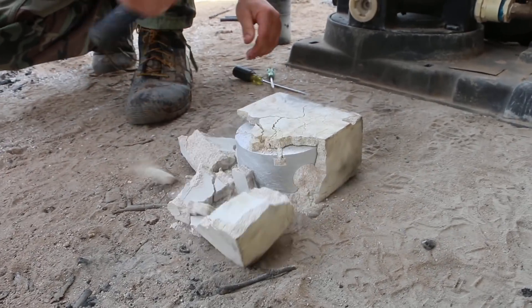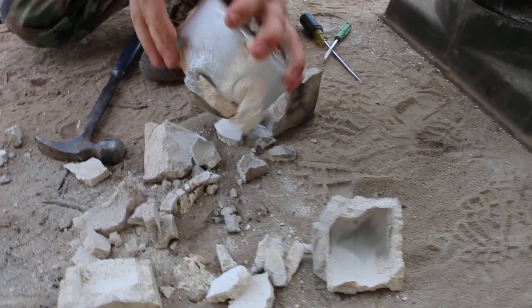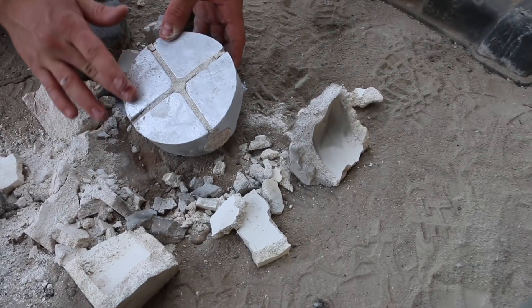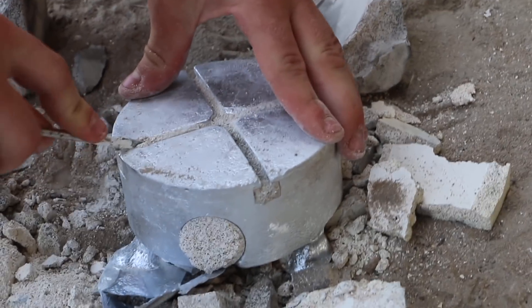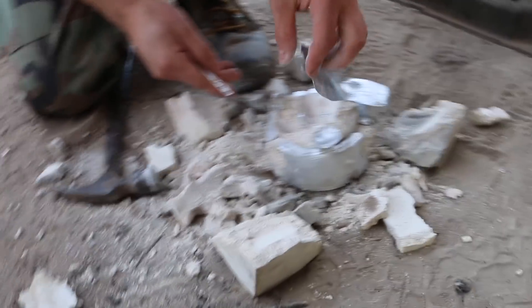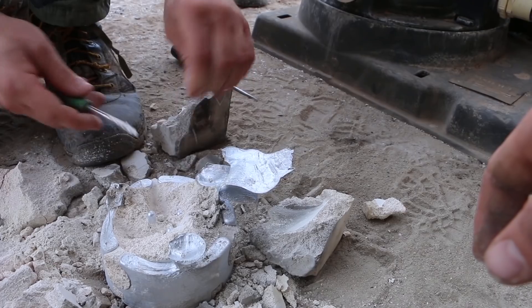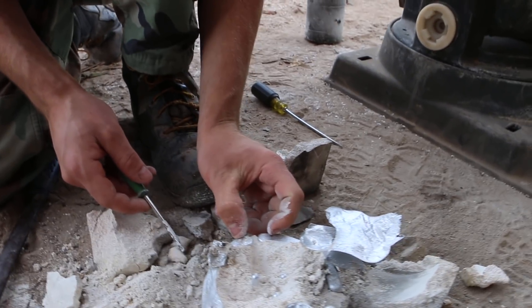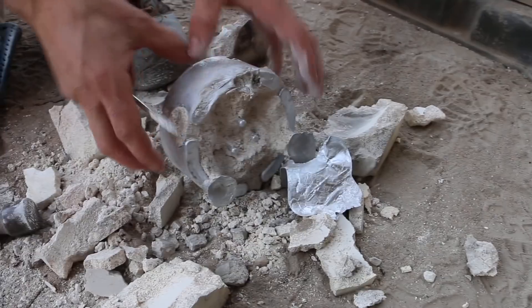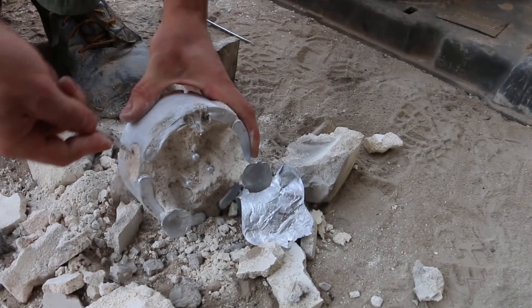Let's get this thing open. Oh my — whoa, way better than the last one! Yeah, you just didn't have enough aluminum and didn't have high enough risers on it. You need higher risers and it would have worked. Look at the same size — the layers of the plastic bottom are perfect where there was enough aluminum. It looks a lot better than the last one, so we're definitely getting somewhere. Looks like I just need a riser with a lot more aluminum pouring into it.